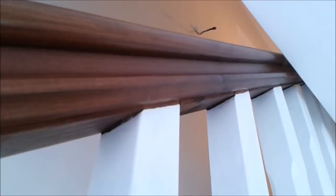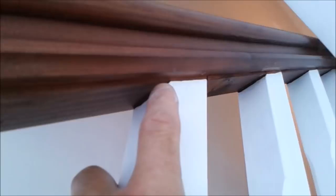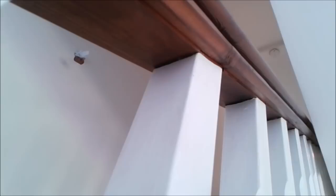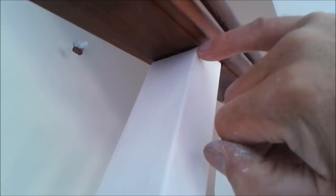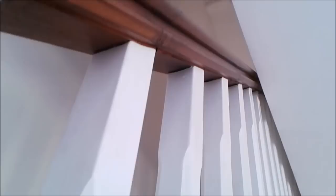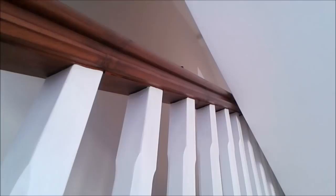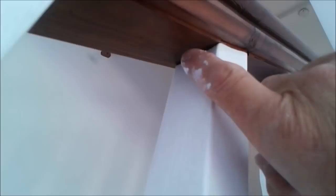When painting spindles with a wood-stained handrail, notice on this back edge of the spindle I've not gone all the way up to the underneath of the handrail, following that angle through. That way these back edges won't get any paint on your handrail. I leave just a slight gap at the back edge — probably about 4mm or 5mm — to keep the natural handrail clean. Generally when you look at the staircase it looks fine, a lot better than if you paint right into that corner and start getting paint on the face edge.